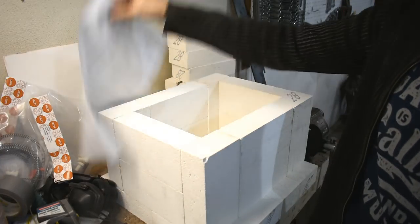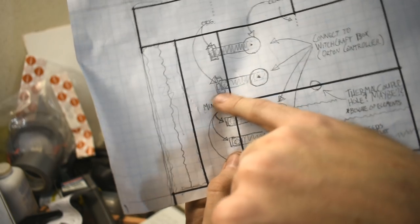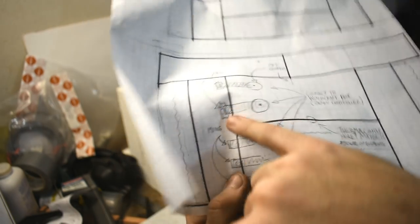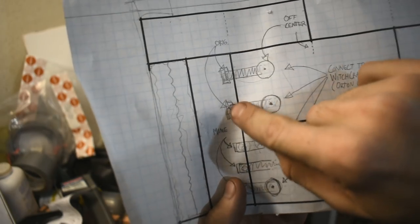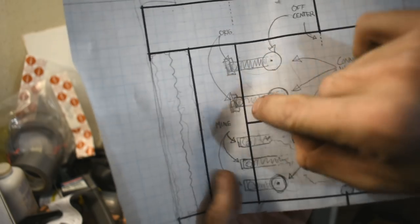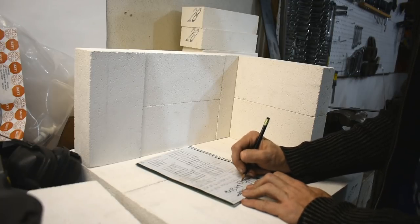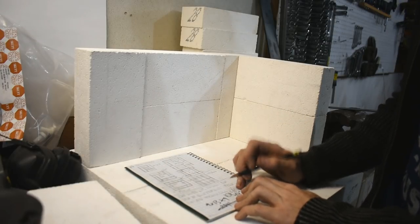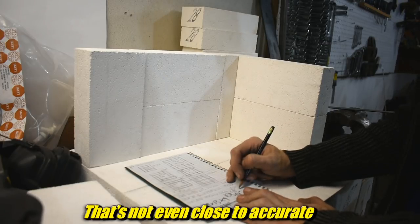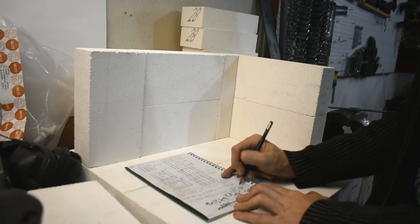Next issue: placement of the grooves. People rightly reminded me that a lot of the extra space here is for expansion of the elements, but there's a little bit of expansion width-wise, and the vertical space is ridiculous. So we're going to give it some room to expand, but not so much — with them crammed together like this, we don't want these little cutouts getting too close to each other and a little bit of fire brick breaking off. Measuring the elements — the elements are a coil. The width of the coil on that element is 3/8 of an inch, outer to outer sides. So I need my groove. How much will that expand? Let's say it doubles in size — that puts us up to six eighths, three quarters. Math. I can do math. No, I can't.